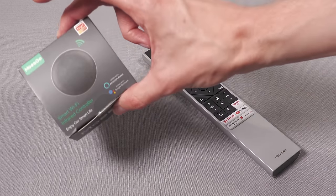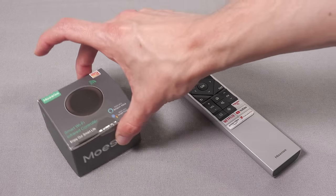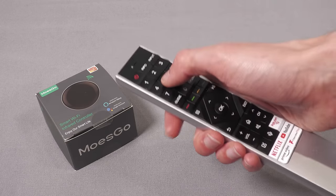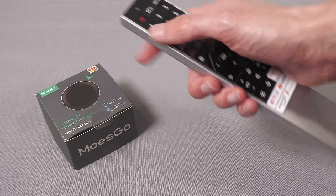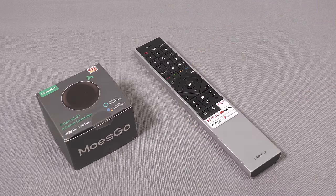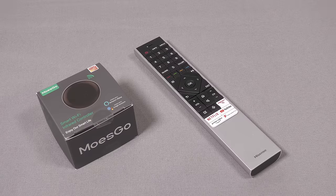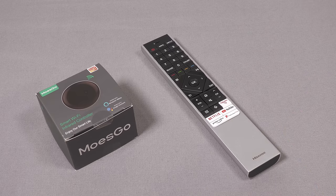So I'll use this little Wi-Fi based infrared transceiver running Tasmota connected into Node-RED. Once all that's set up, I'll be able to use this remote, press all the buttons, and if the button needs to be translated to control a different device - say I press a number for my satellite box - it'll send a signal to this, this will talk to Node-RED, Node-RED will translate it, send the translation back to this, and this will send the signal back to the satellite box. Admittedly it's very over-complicated and I'm relying on a whole home network server, virtual machines, Node-RED and many other things just for remote control to work.